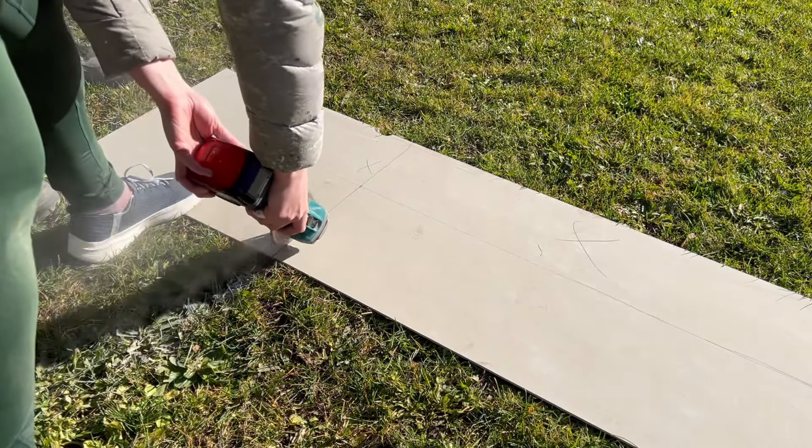We're diving back in, starting off with mixing up some tile glue so that we can get started tiling the shower side. Getting the tile glue consistency correct can be a little bit tricky — it was way too runny so I added a whole lot more glue and kept mixing until it was thoroughly mixed. When it's the right consistency you should be able to lift it up and almost get a peak as it pulls out of the tile glue container. I did the same thing as on the other side of the room and set up almost a frame for that first tile to sit on, just to make sure I had the tiles at the right height and a nice level plumb line for that first line.